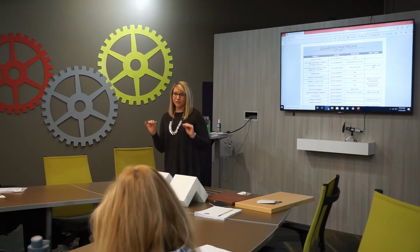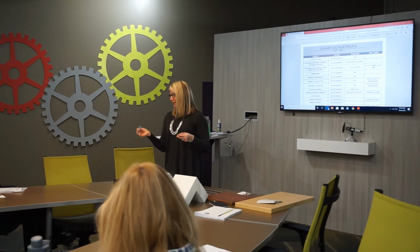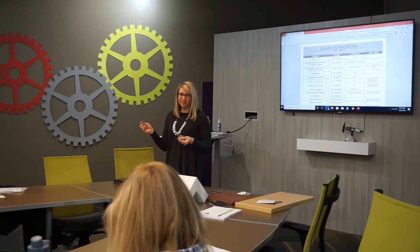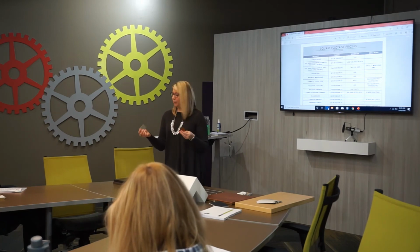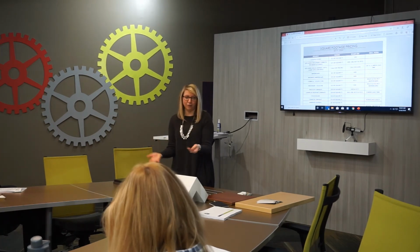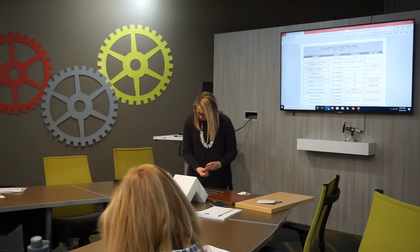Actual metal is going to scratch. The minute you put it on a work surface, it's not recommended, and we'll write that all over your drawing. It will scratch anytime you use it. So again, you run into edge details, but it's always an option. A lot of times we'll put it on the front of modesty panels, where it's not as fragile. But some people are insistent on their surfaces, so we'll make a note: be careful, it will scratch over time. It's not covered under warranty if you use it that way, and you just have to roll with it.